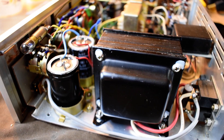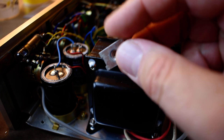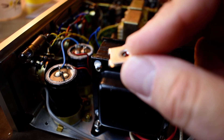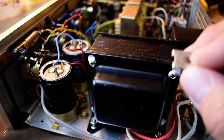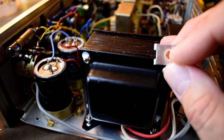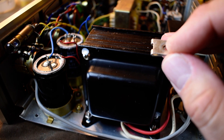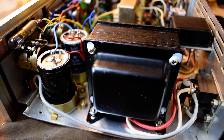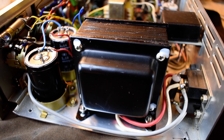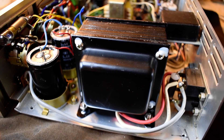And a very simple fix. See here — it was actually screws through speed clips. Now this is interesting because I looked at pictures of the one I restored in 2018, and it had nuts and bolts. I'm like, well isn't that interesting? I don't know why it has speed clips. But the problem with the speed clips is something this heavy — it doesn't secure it well and they loosen up.